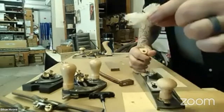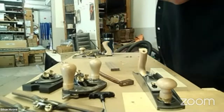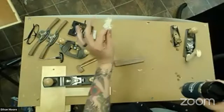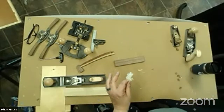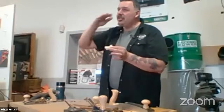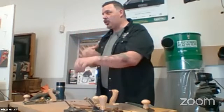It's next to nothing — it's like fishnet stockings. This isn't me trying to show off; this is just a sharp blade in a tool that's nice and flat. And if this wasn't flat, you wouldn't get these shavings. What happens is that the blade ends up having to stick out further in order to get the cut, and then you're going to get variations of cut. You'll know right away if it's not working — if you're not able to get a consistently thin shaving out of a plane, there's probably a hollow spot somewhere on the body or the sole.